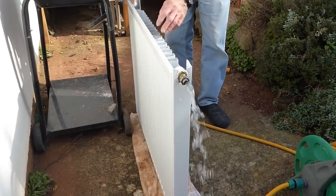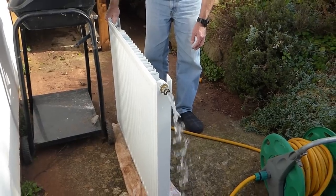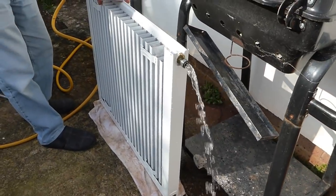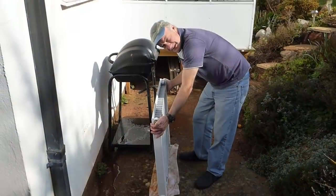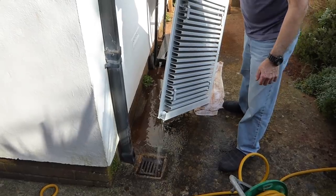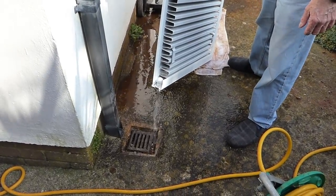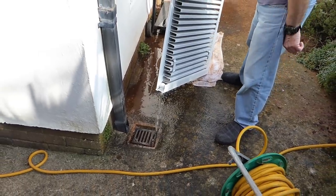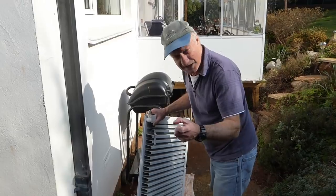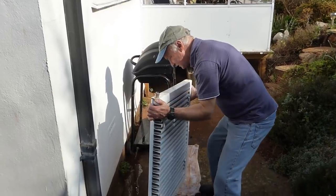Because we've got it up this way we're flushing it through that way. Keep the hose on it, run it completely clear, then go to the other end. You may need to do this several times until it all runs clear — depends how bad it is. When you're happy it's pretty clear, turn it up the other way and let it drain out into the drain. If the pressure from your hose is a bit slow, turn it up on your main stopcock and give it full pressure so it really blasts in. You can use a jet trigger to give it more push — get as much pressure in there as you can to get that black sludge out.